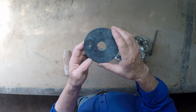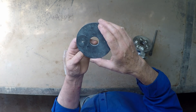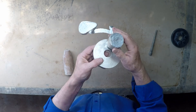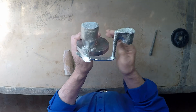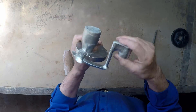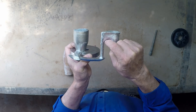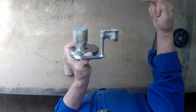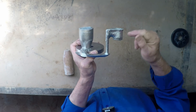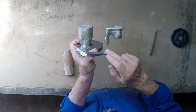It proved to be an excellent example of how we can use nice gating to really give us a good looking casting, and this is the gating I actually used. We have our pouring basin here, our tapered sprue here, and there's a ridge between them. The ridge stops any metal I'm pouring from going straight down the sprue — it forces the metal to first collect in the basin, then go across and then come down the sprue.